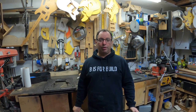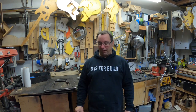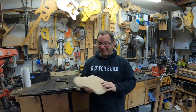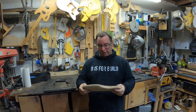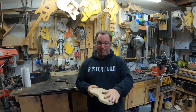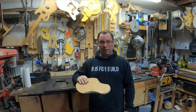I'm pretty happy with how making the backs is coming along. There's probably a better way to do what I'm doing - it's probably the English wheel, but that has a steep learning curve and I don't have one, so I'm going to press on with pressing. The one thing I'm going to do differently is make a new Easter egg, probably out of maple or something much stronger than this particle board. I want to give it a little more curve and tweak the shape just a little bit.